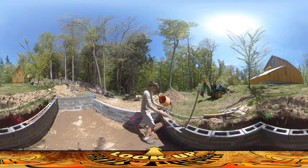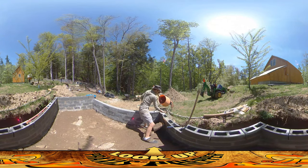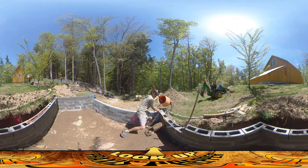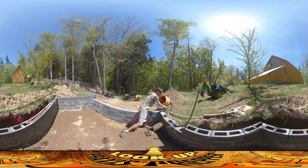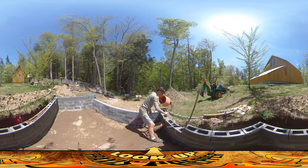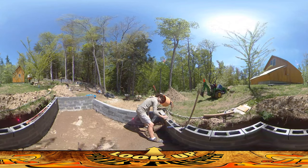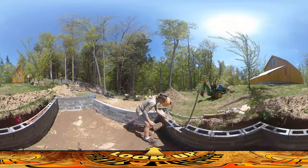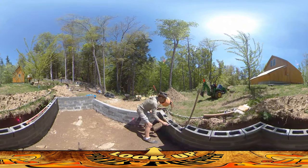Now this is where the door is going to be, so I wanted to have one of my pins here. The piece of pressure treated wood is going to go down here and extend all the way over to here. So I've got one pin for that, and this is the last pin for this piece of pressure treated wood right here, so it extends over here. One pin is on the outside, so this pin I'm going to set closer to the inside — not all the way on the inside because then it wouldn't be central enough in the board. See how I'm dancing this in the same way I did the stick, and it gives me a really good sense of what's vertical, being able to rest that right on top there.